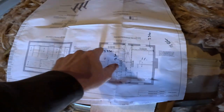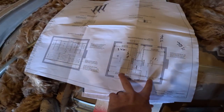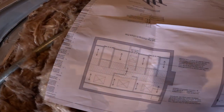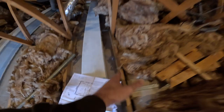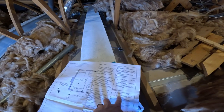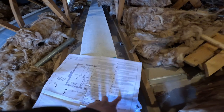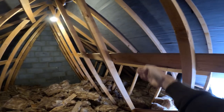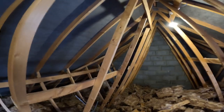So built on top of these will be our dwarf wall. And then at the front we'll have our two pitch roof dormers - this is the front - so our pitch roof dormers will be built on top of that steel, where you've got a small indentation. The spec we've got here is 9x2s at 300 centres, so you'll have them every 300mm all the way across. The rafters on this are going to be doubled up with 6x2, and then the actual ceiling collar - so if you can imagine what we call the collar at the top - it's 6x2 as well. So we're going to have 6x2 rafters and 6x2 collars all the way through, with a ceiling collar going onto a doubled up rafter, and then a steel at the bottom which will have our upright dwarf wall on it. So effectively we're building a whole new roof inside this roof.